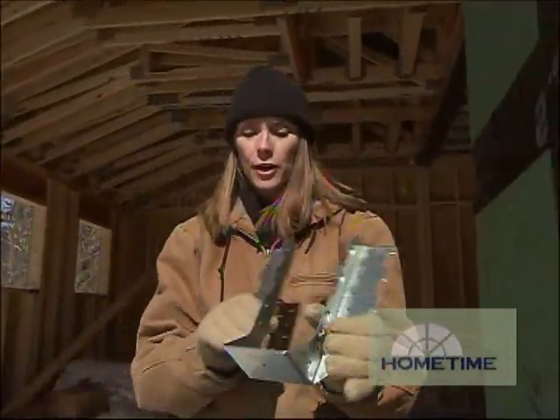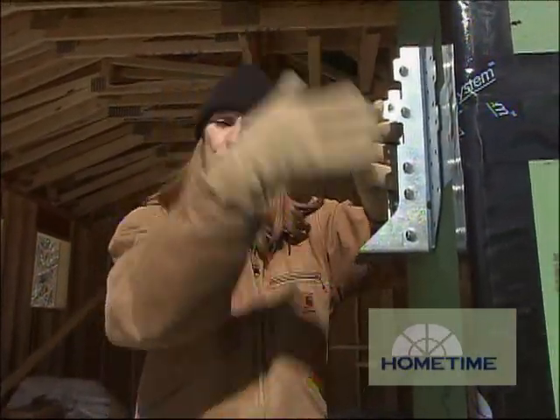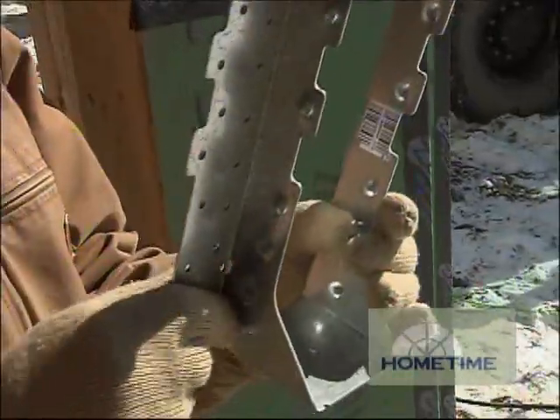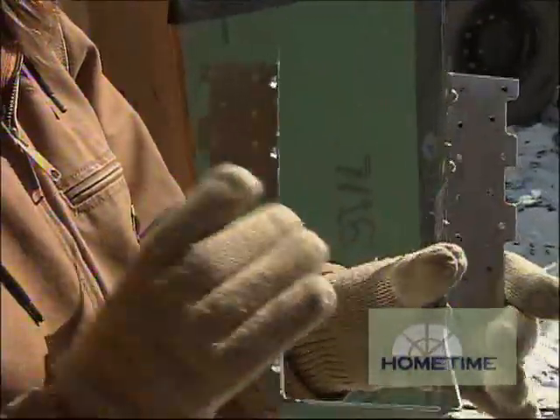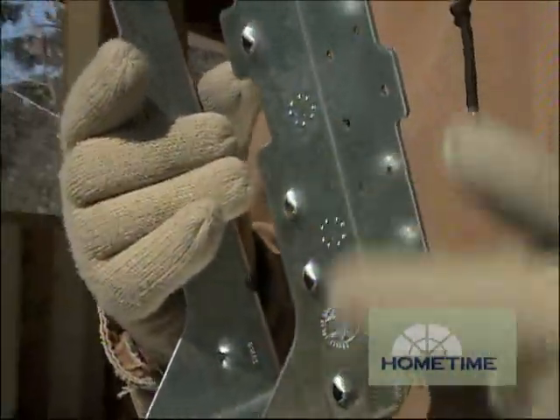This one's pretty self-explanatory. The face just gets nailed into your support piece and then whatever you're hanging goes right here and nailed in through the flange. This one has 40 holes which is a lot to do by hand, so the guys do have a joist hanger gun that they use just for this. The holes on the flanges have these hoods on them which sends the nail in at an angle — kind of handy if you have some framing nearby. And the holes are also offset so you're not going to have nails running into one another.